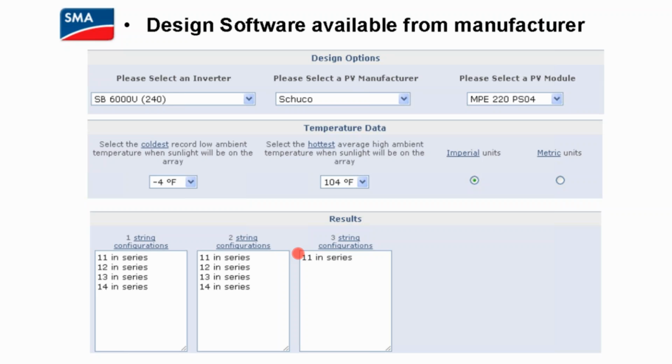And so the string inverters also have this reputation for being very limited, because say I could do a 26 module array, or 28 module array, or 33 module array, but there's no 29 or 30 or 31 or even 32 configuration. So, what I do on my array layout, I might have to remove a few modules to get it to work. But on string inverters that have multiple power point tracking, so not just one MPPT, but multiple MPPT, the strings no longer have to be uniform. You can have them facing different angles, different directions. You can have different numbers of modules on different circuits.